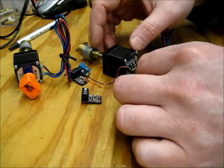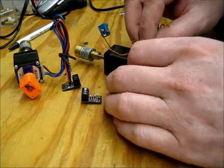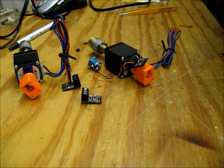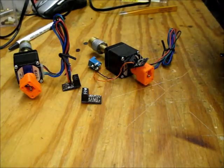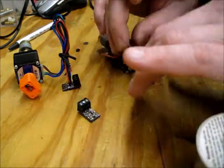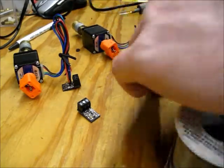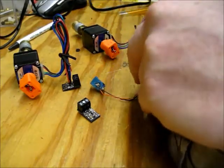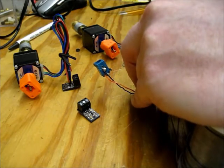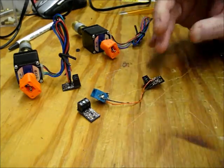and I gotta solder them, which will be very fun and interesting for you guys to be able to see, but I'll try my best. So to start with, I'm going to fill one of the holes on the board, just one. That way I can reheat it so the solder's liquid, push it over the pin, and then let it cool quick while not having to fight the other 4 pins.